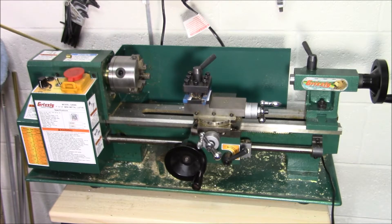One other consideration is the type of motor and gears. This particular lathe has a three-quarter horsepower, 110-volt motor and uses plastic gears. Some people have a problem with that, but I don't. Going back to my old RC days with nitro engine cars, you typically find plastic gears because if you're going to have a failure point on a piece of equipment, it's better to have it on a small, easily replaced gear than on a more intricate internal mechanism.